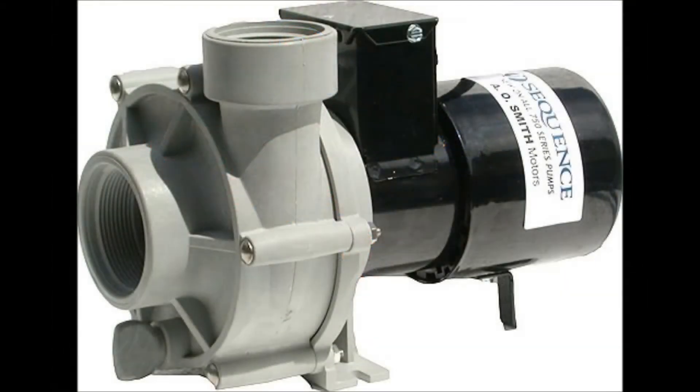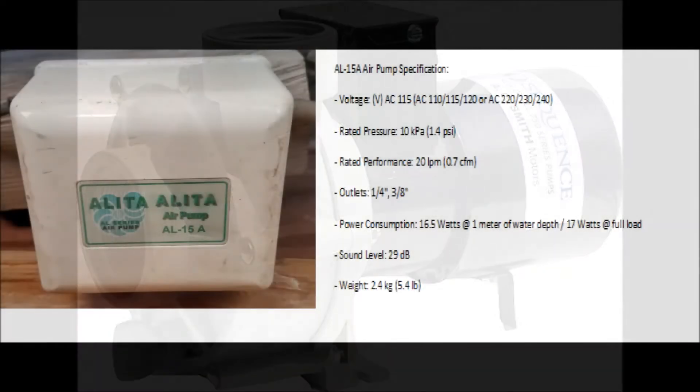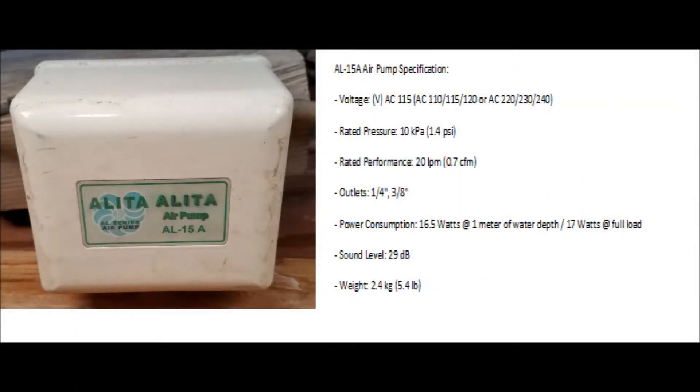The water pump draws about 150 watts of power. This is too costly due to the large bank of batteries required to run continuously during an outage. I wanted a system that was completely automatic when I'm out of town and had reserves for at least three days. So if the power went out, my water pump stays off, but the pond is aerated only with my air pump. I replaced my air pump with this efficient 17 watt unit.